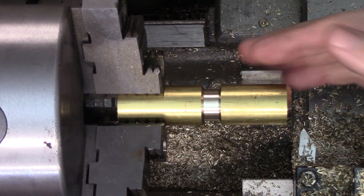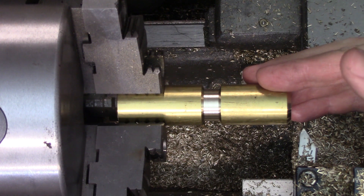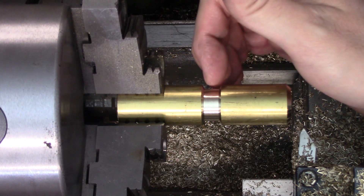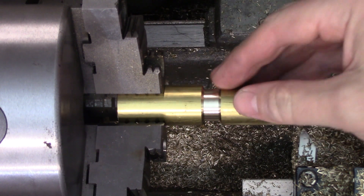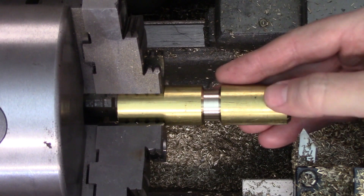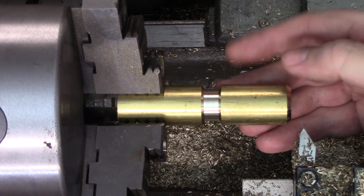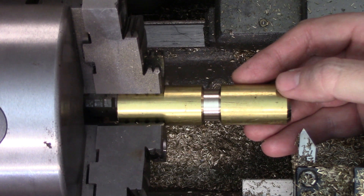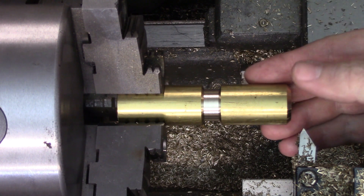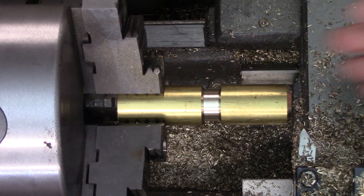Now I'm going to do Jonathan's suggestion, and I'm going to do this one exactly like I did in the first test — no center support. I'm going to do this at 75 RPM first because that's the corresponding back gear to 410. I figure if I'm going to do this at high speed again, I might as well do it at the highest speed I did before. That'll show the best results, because 75 RPM still had lots of chatter and 410 did not.